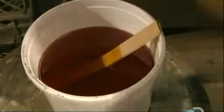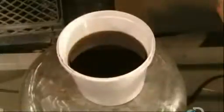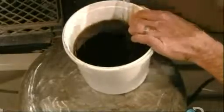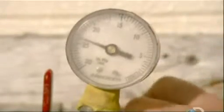Meanwhile, they activate some plastic resin with a chemical catalyst. They place a hose in the resin. The other end is attached to the vacuum bag. As the vacuum continues to draw air out of the bag, it pulls the resin into it. The resin saturates the 7 layers of carbon fiber to laminate them into the shape of the car part.